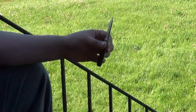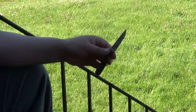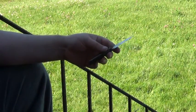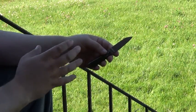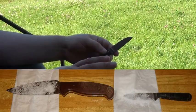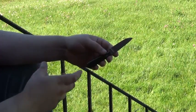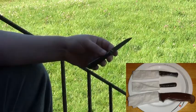A while ago, I did a corrosion resistance check using this knife as the baseline, because it's O1 — it has almost no corrosion resistance. What I did was cover a number of knives in table salt, just poured right on them, completely covered them, saturated it with water, wrapped it with a napkin, saturated that, and left it for 12 hours overnight.